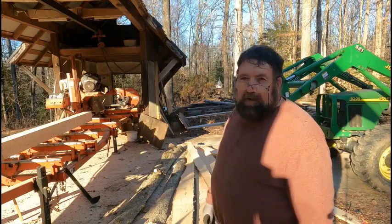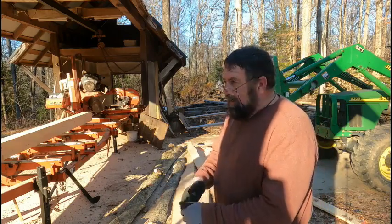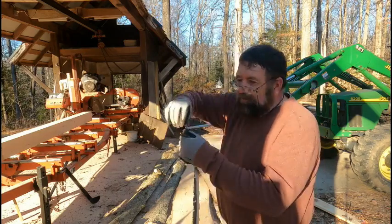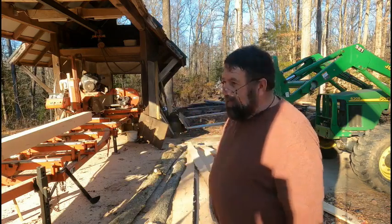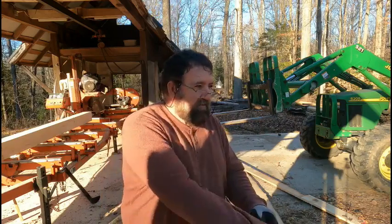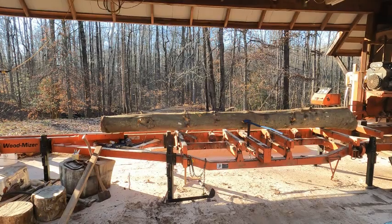They sent me a second belt, and it wasn't much better. So I don't really know what the deal was with that, but it works. You know, that belt will stretch. And I could loosen up the nut and adjust the motor speed, but I don't want to get in too big a hurry. No sense in burning through blades and tearing stuff up. So let me get this mess cleaned up, and then I'll get that beechnut back on here.